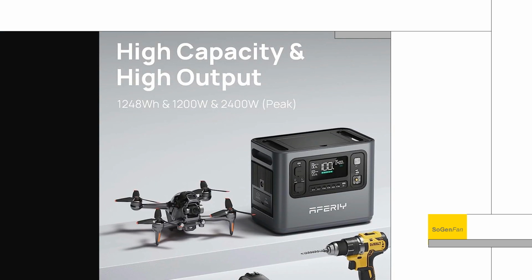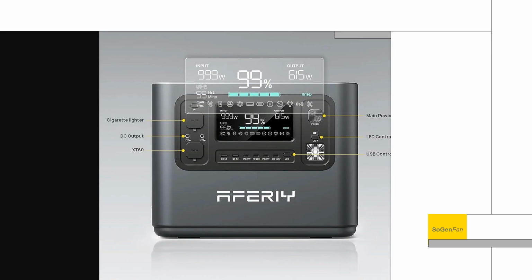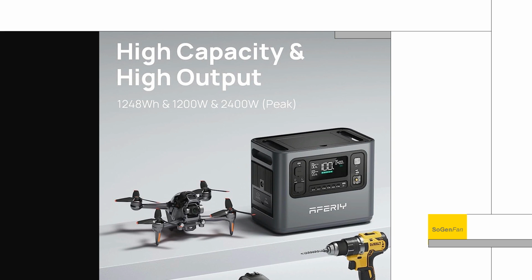Just a heads up, it does have pretty good, well rounded, top shelf stuff, really, for this size class. This is a 33-pound unit, so keep that in mind. We get 1,248 watt hours, and yes, it is using an LFP battery. For the inverter, we get 1,200 watt continuous. There's no special voltage dropping boost mode with this unit, and there's no app. 1,200 watts is what it's rated for, 1,200 watts is what you get.